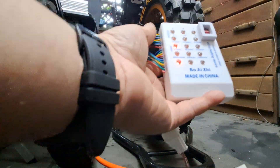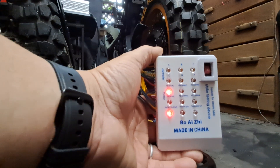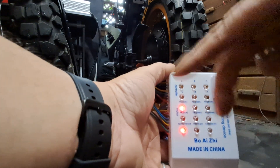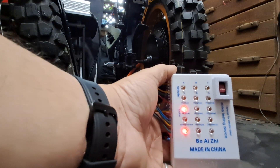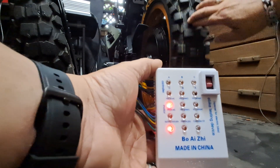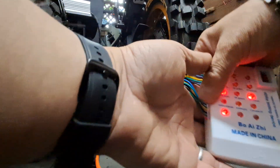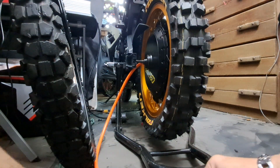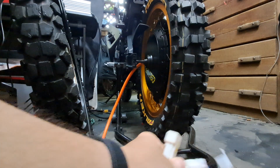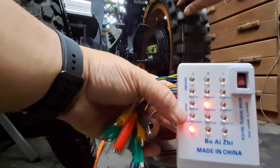I'm not sure if that's the reserve or the main one. Sometimes it's hard to see these LEDs lit up on there, but what should happen when I spin his wheel — if all the hall sensors are working, there are three of them, just like there are three phase wires. You've got three hall sensors: the yellow, the blue, and the green. When I spin the wheel, it should alternate between all three if they're working. And as you can see, it's spinning between all three. Now I'm going to switch it to the other set and test those — obviously they're working because I just fixed them.